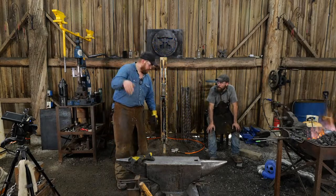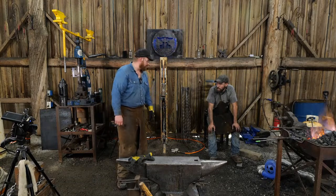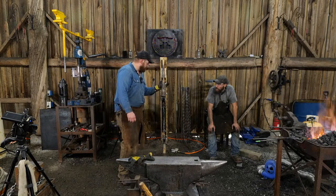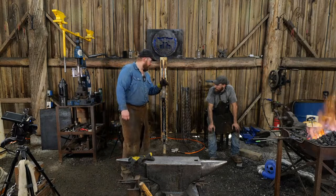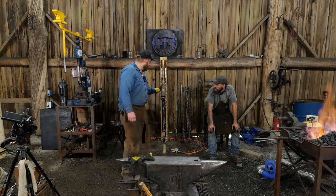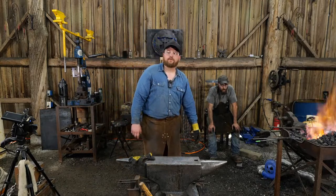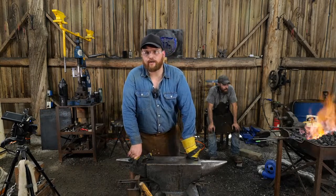I'm doing a show tomorrow, so I don't have the anvil sitting here because I've taken that as a little portable demonstration option. But this here is, what is this, I think it's a 12-pound head. So you would have to upgrade this to like a 20-pound sledge probably, beef up the springs, and move everything up a little bit so you could get some good connection on it. But you can most certainly use the treadle hammer kit to do that and work the piece out, especially if you don't have a striker.